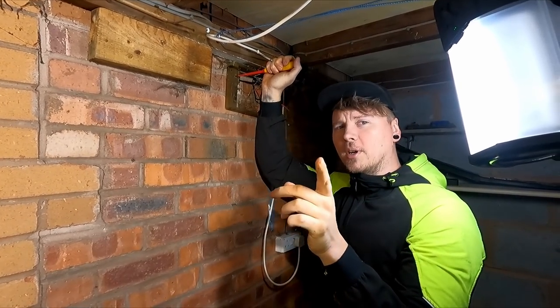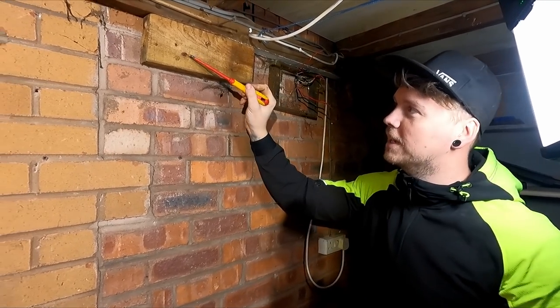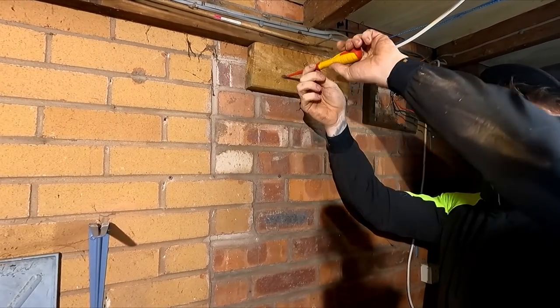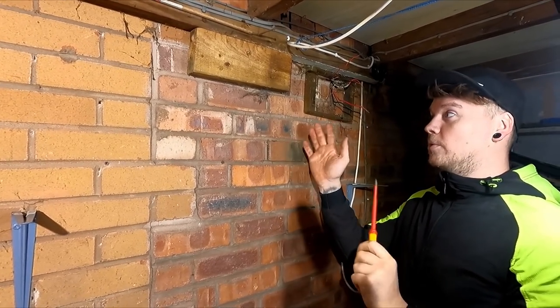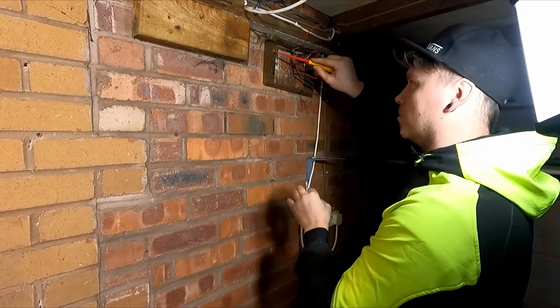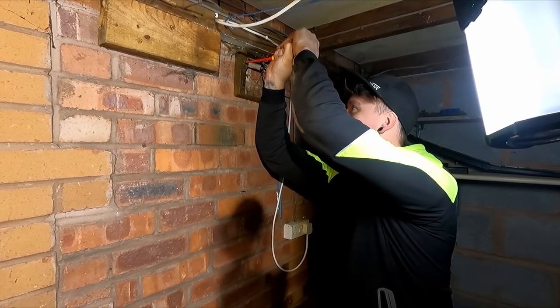So, also, top tip. This is probably not going to work now, but any flathead screws, you see this one here? My granddad was a carpenter, and he would say to me, never just try straight away to turn it and get it loose. He said, wiggle it backwards and forwards. Do that, tighten it up to the point where it's loosening itself up enough that you should be able to help you out. Probably not gonna work now, but we'll give it a go.